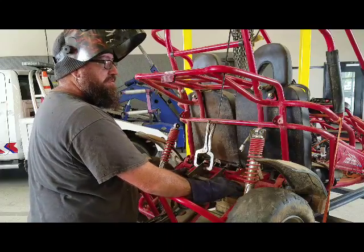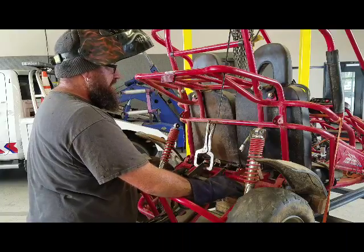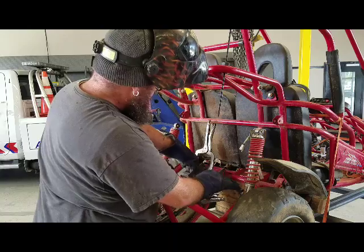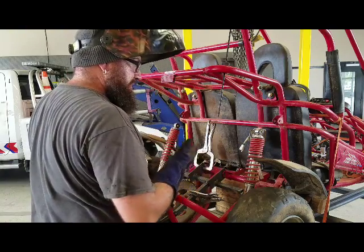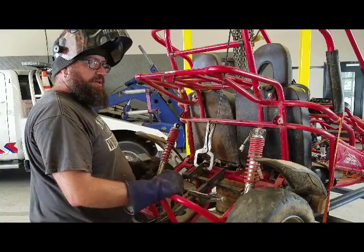I've always patched them if you can get in there. Well, yeah, plugs, I mean, that's fine, but you can't just think it's fixed and keep on driving. I like patches. I mean, patches really are permanent, as long as it's in the tread area. You can patch an oval hole or whatever.